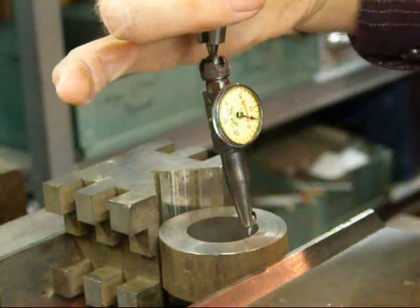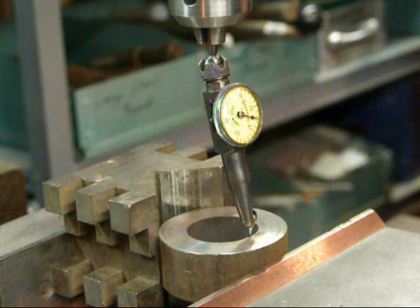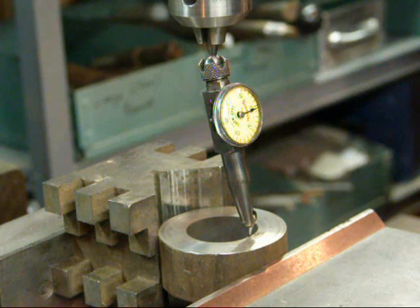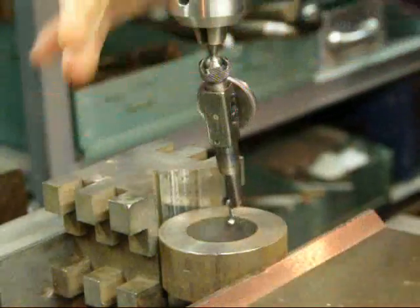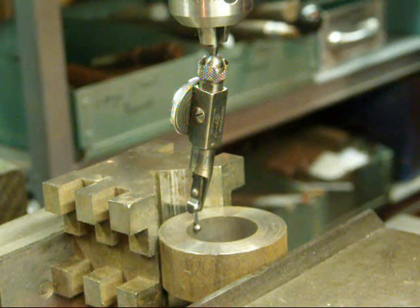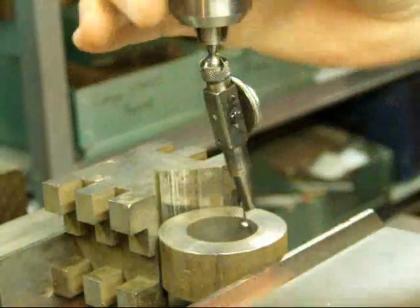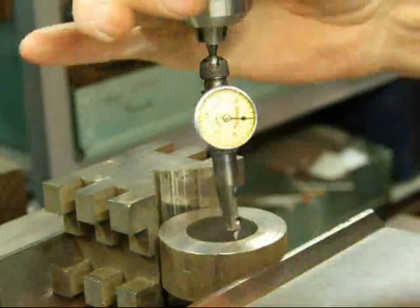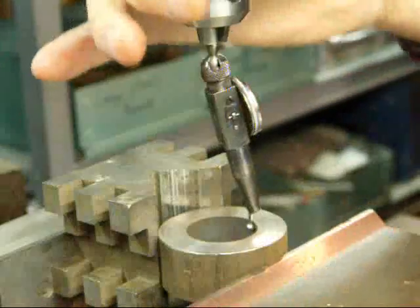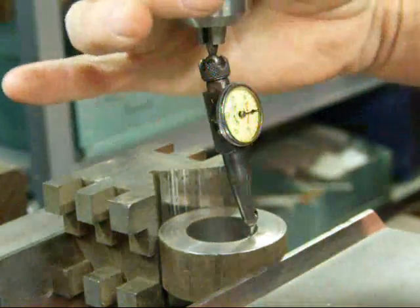Now let's check it in the y-axis and I'm very close there already, within about three thousandths. So I'm going to move the y-axis in just a little bit. I don't know if that's going to show up or not. Zero that out. Now I'm going to turn it toward the back, which of course you're not going to be able to see. And I'm within one thousandth. So I'm going to move that half that amount. And it's on zero there. It's on zero there. And we're facing it the other way and we're on zero there.